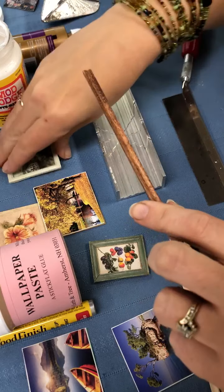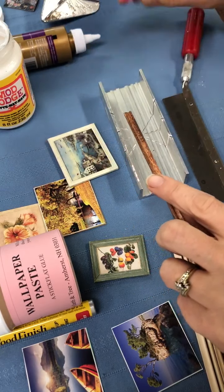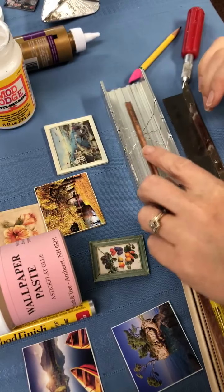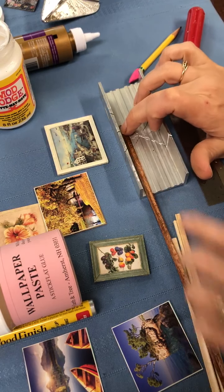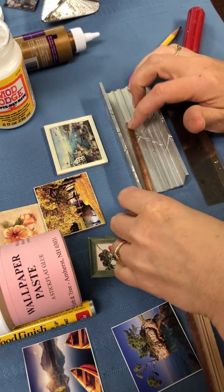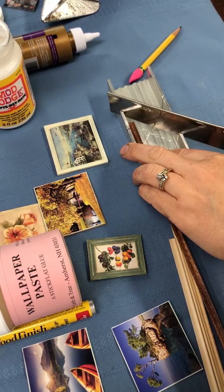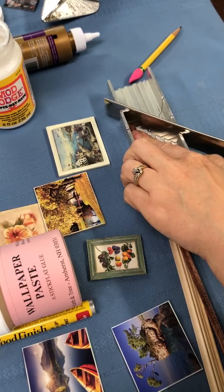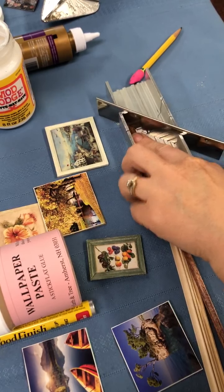With the picture frame looking right at me, I'm going to do the top piece first. You can always draw a little pencil line on there if you need help visualizing, or draw a little diagram of which directions the miters go to help you remember how to lay the stick in the miter box. So we're going to lay the face down right here in the little channel so it prevents the piece from sliding around. I need it to lay flat, so I'll lay the back part right in that channel — it hugs it nice and snug and makes it flush. I'll take my miter saw right in the 45-degree slot and just a little light sawing action. You don't want to push hard — it binds up the saw. The saw wants to do all the work, so just lightly back and forth until we're all the way through.